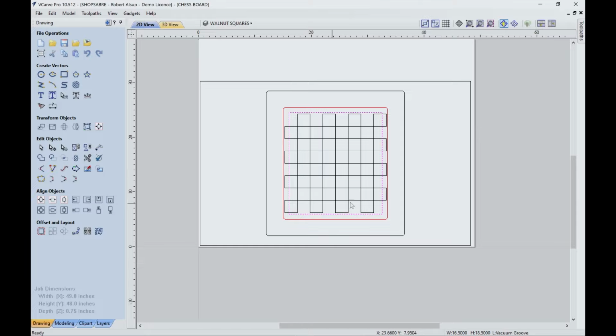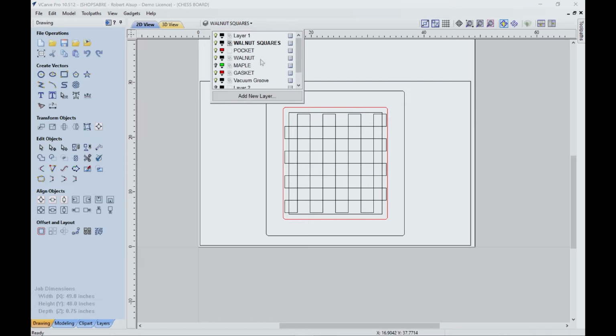So you have vacuum coming in here, and then you have a gasket to seal the perimeter. And then when you put your panel on there, that'll hold it in place. And we also have some part locator pins that we're gonna employ, because we have machining on both sides of a part, so we need a way to locate that.